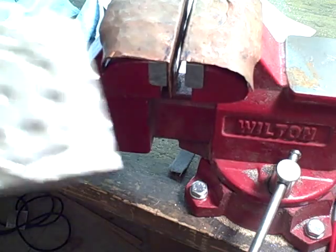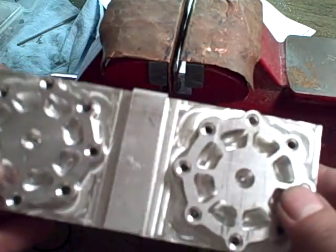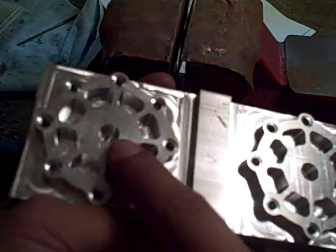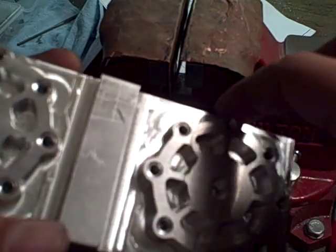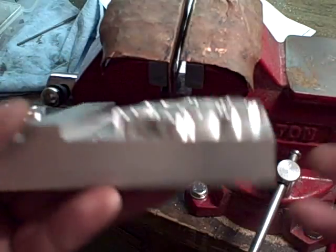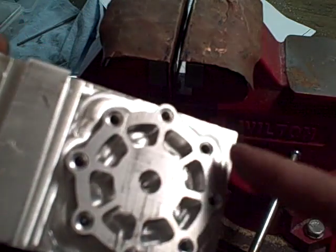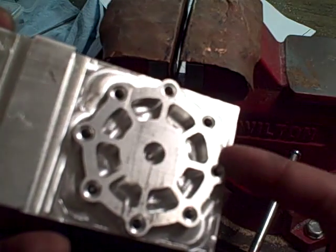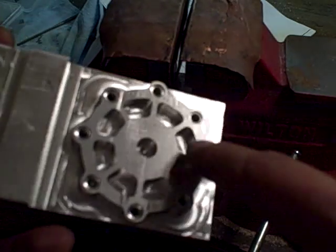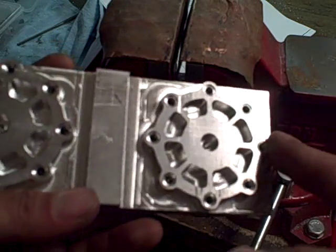This is the first CNC project I ever did. I programmed this — it's called a wagon wheel. This is the instructor's test cut, and this is mine. The reason it's pretty cool is — I mean, I don't know what I'll do with it, maybe it'll just be hanging out on my desk, or some people cut it out and make it into a keychain — but the cool thing is it teaches you how to program all the different angles, pocketing, and the different functions. These holes are all drilled and tapped, so these are all teaching you the different functions you can do with a CNC machine.